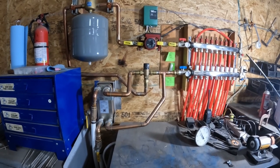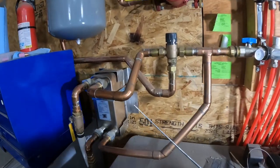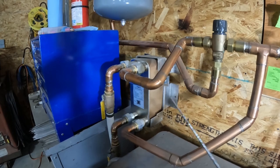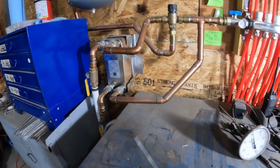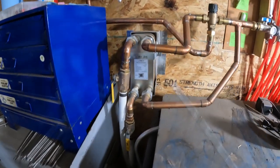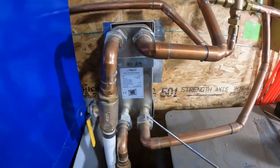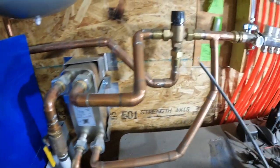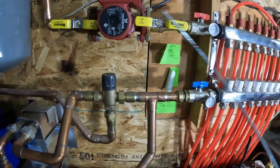It took me months to nail this down. I made my own wall mount rack out of sheet aluminum I had lying around — bent it up by hand, though a sheet metal brake would have made it easier for material just under an eighth-inch thick. Everything here is connected with dielectric couplers with high-temp seals. A couple places are a pain to adjust, so I used SharkBites there to make it easier to slip the whole unit on and keep my flange valves properly aligned.